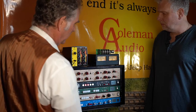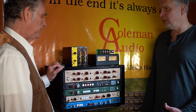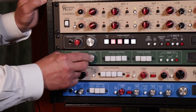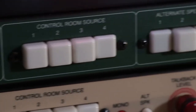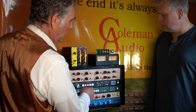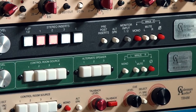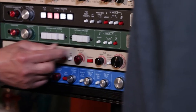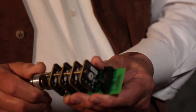There's an engineer's headphone — and that's the TC4. The M3PH Mark III has the same 47-position step attenuator. There are four selections that you can AB sources, and three alternate speakers that you can AB. On number three there's an internal switch that makes it fixed so you can send it out to a pair of meters. There's a mono switch, left and right mute, and a phase reverse which gives you the side channels again.